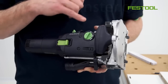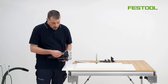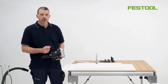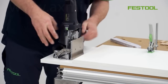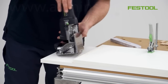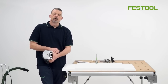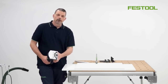The first cut I make will be set in the tight position, and then any subsequent cuts along the side means we can then move this to the open position. This gives me a small amount of room with the domino to move it into position when the cabinet comes together. The big advantage of working with the domino is that the distance from the base of the machine to the center line of the cutter is 10 millimeters, so I need to allow for that for any marking out I do along the side of the cabinet.